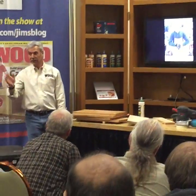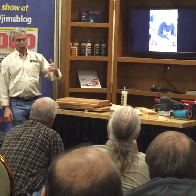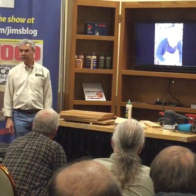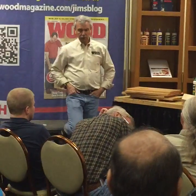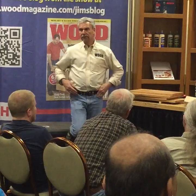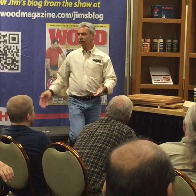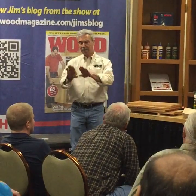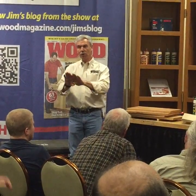And I could tell you, oh yeah, there's biscuits, there's dowels, there's Dominoes, a $900 tool. All of that stuff in there wouldn't have made that glue joint any stronger. And with washing the glue joint, no glue in the pores or anything, none of that stuff affected that glue. My feeling is, and again, for what it's worth, that over time, we have let tools and things get in the way of what joinery actually was. I mean, we're finding something else to add to this mix, when really all you need are two edges that meet, and the smoother the better, and a clamp system that just holds it that way.